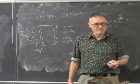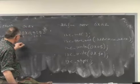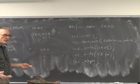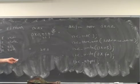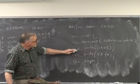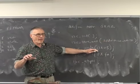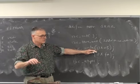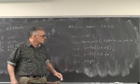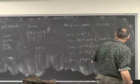So, what was up again with the 2 write statements? So this is the address. The ROM is laid out as 0 through 255. It's 256 8-bit values internally. And we want to write to location 5. We want to write an FA to location 5. And so these are commands. This is the address of the ROM. This is the address within the ROM. So this is a command to the I2C bus. This is a command to the EEPROM. And FA is the actual value, the data that's being written in. Yeah. So this is the address. The data.